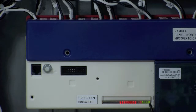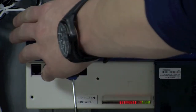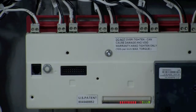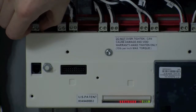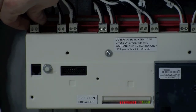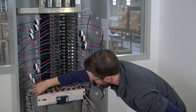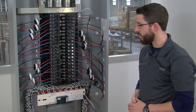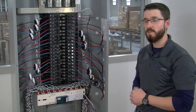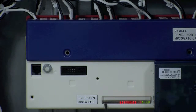The far right set of green LEDs tell you what type of configuration is loaded onto the i636. The red LEDs are load lights that will blink depending on how much load is on each meter. Over here on the left side we have an amber LED. If we have any amber LEDs, this indicates that there is a problem with the installation of one or more of the CTs. We can start our troubleshooting by removing the cover and unplugging each CT one at a time until that amber LED goes away. As you can see, when I remove CT number one the blinking light goes away — I'll put it back in, we've got a blinking amber LED, and now it's gone. This tells us that there's a problem with the installation of CT one. It could be a problem with the CT being installed in the reverse direction, the CT leads could be reversed at the two-pin connector, or the CT could be installed on an incorrect phase. These would be all the areas to investigate, and once you find where the problem is, make corrections accordingly until you have no amber LEDs on the light bar.